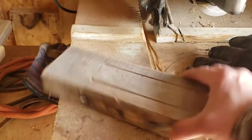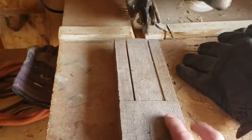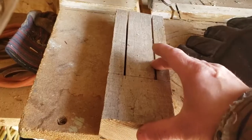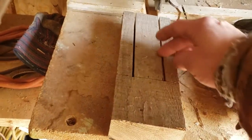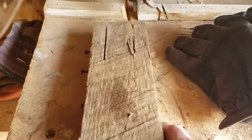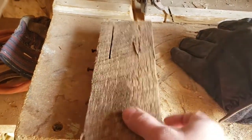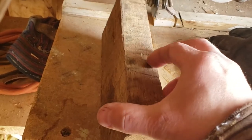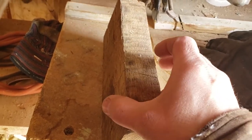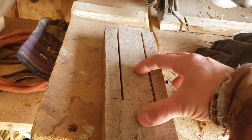And I'm cutting in the handle with my radial arm saw. I came in on this one side here, cut, and I marked down here for the cutout that I'm doing right now. I cut out here, and with the round of the blade, basically what it's doing on the back side, I'm gonna bring this up to here too, but as you cut out here, it's gonna leave a taper in the middle here for the blade.